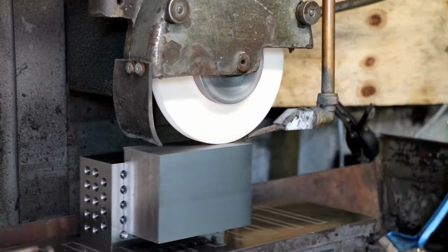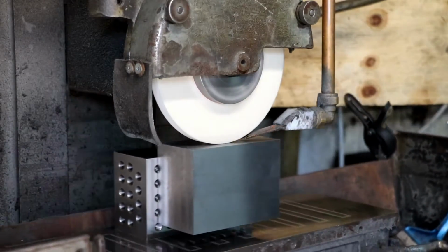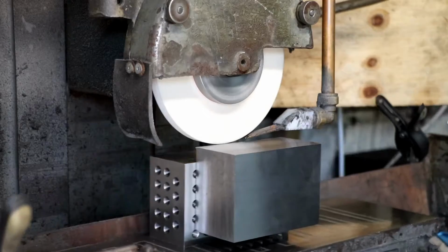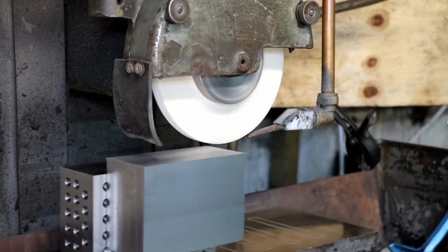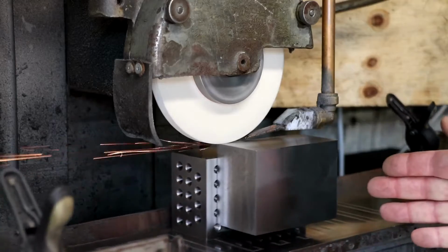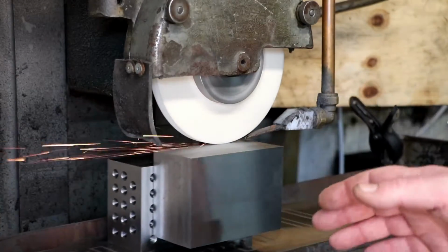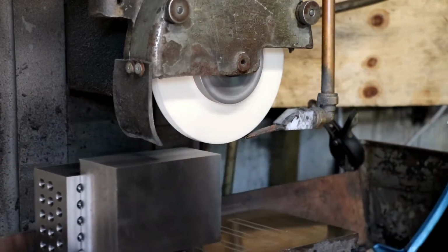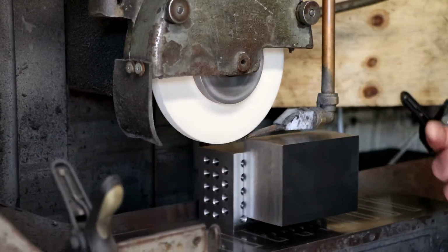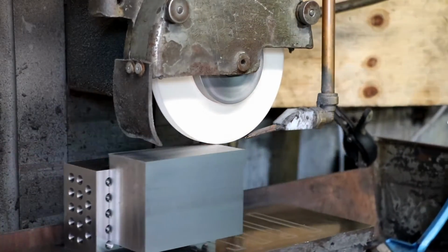Now, yesterday what I found, I'd come across a part like I am doing now across the block, and I decided that when I went back and started again that I was going to come across considerably quicker. Which, if you're doing something that's not all that critical, is fine. But what I found with my machine is, that little lever there that I was just pointing to, the more you have that on, the quicker it bangs, bang, bang, when it gets to the end of its stroke. If you pull the lever back, it's a lot softer, the transition. But I had it going quite quickly. When I came across and sent it back, I actually went across backwards and forwards 4 times and it never stopped sparking out. It was making the machine move that much that the head was dropping. There's something else to bear in mind.